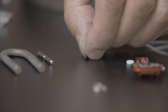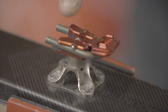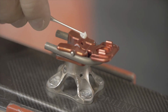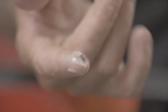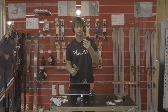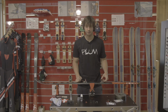And finally, last but not least, you need to replace the small elastic pin, which will go inside here to prevent the big pin from moving sideways. The tip is to use the small pin drifter and a little bit of grease. You place some grease on the hole here, then place the small pin on top of it vertically. Then you take the 2.5 millimeter pin drifter and go on top with the hammer to push it back in place. And here you go.